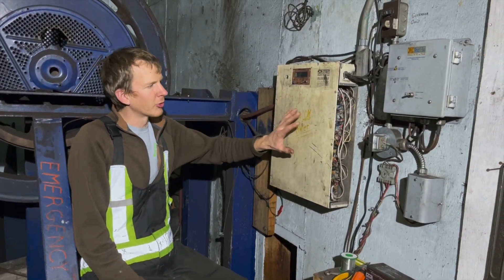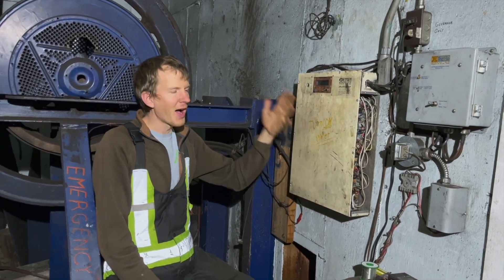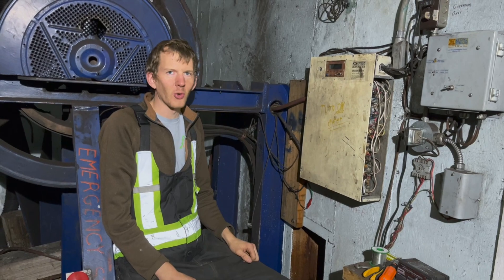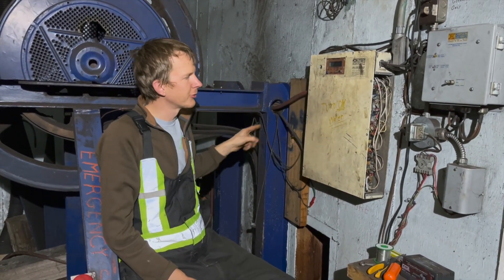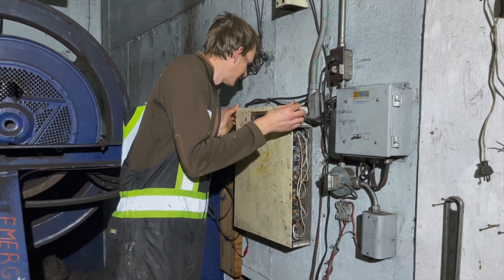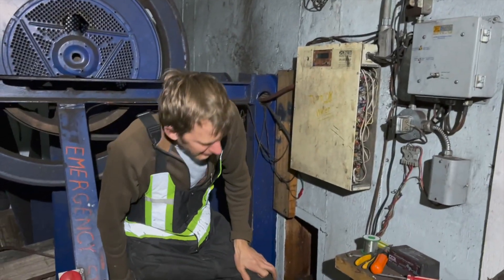You can imagine this being like the world's smallest hot water tank with the most elements — five elements in what looks like probably three or four liters of water — and water runs continuously through here. The reason we're deep in here is because we actually forgot to supply it with water, and that caused some issues. It's hard on electronics to say the least.